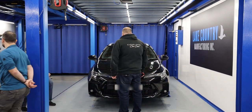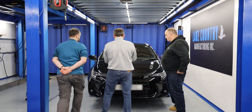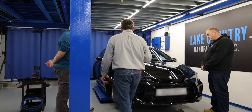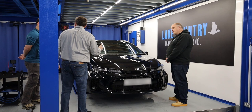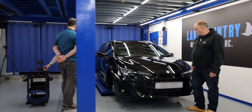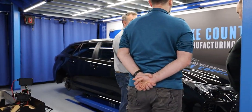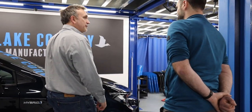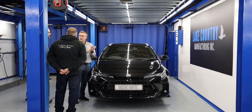By having a strip lamp, I can stand here and just scan quickly — move side to side — and I'll pick up defects without even looking properly. I can see defects, but that also means I can see sinkage on the surface. What people probably struggle with is that a camera always tries to focus on what it sees. If it sees countryside in the background it focuses on that and the surface looks perfect. The moment you focus on the surface, you see all the defects.